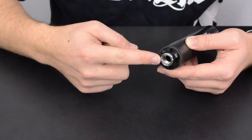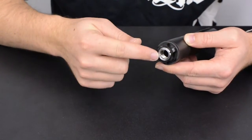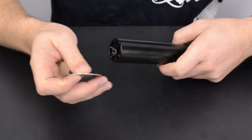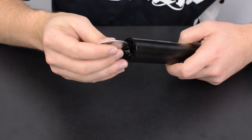Servicing of the booster piston assembly can be conducted from the back — that includes cleaning it, replacing booster pistons, lubing the assembly, and stuff like that. But everything else that involves reconfiguring or disassembling the suppressor begins with removal of the front cap.